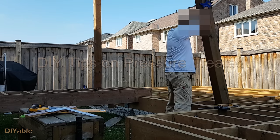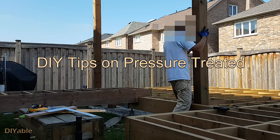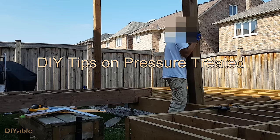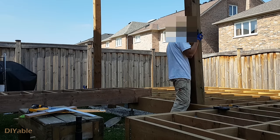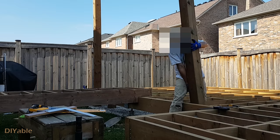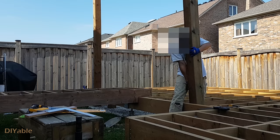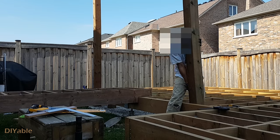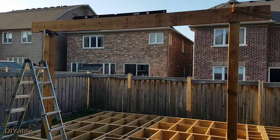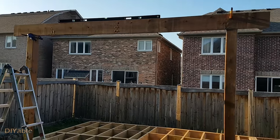Let's attach them to the deck. Here is a DIY tip I want to share with you. Pressure treated wood, especially 4x4 and 6x6 posts, will twist and crack when they dry. You need to install them as soon as you can — a couple of days to a week is okay, but if you don't secure them together for a month or two, you will regret it.